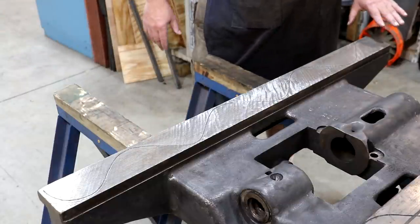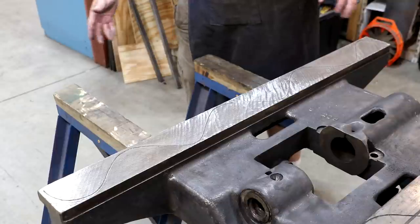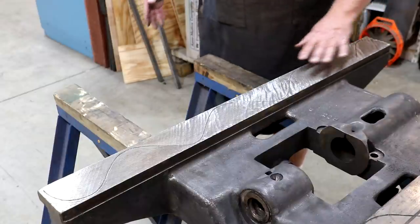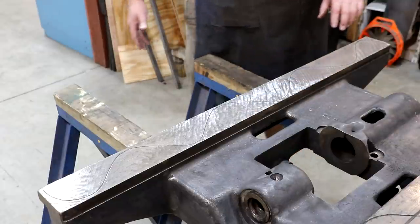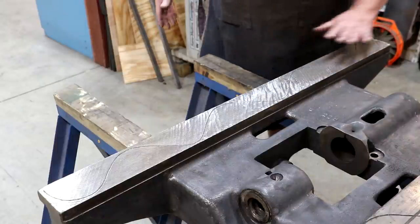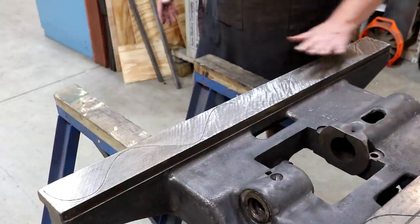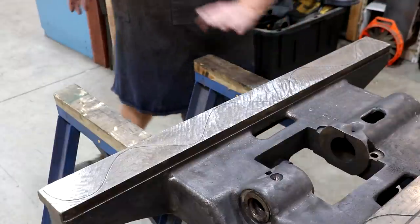Why do we scrape? Number one, I want to make sure that everything is flat. We're moving very small amounts of metal — each scrape mark is a couple of ten-thousandths of an inch deep. By repeating it and going over the high spots, we can get those high spots down. The other thing we're doing is creating little peaks and valleys on this flat surface. The highest highs give you individual points of contact between the two parts, and then there'll be lower valleys in between. That gives a place for oil to get in there and really improves the ability of these parts to slide on one another. If you have two perfectly flat surfaces like came off a surface grinder, they're going to want to stick together. When you put the scrape marks in, the peaks are all in a flat plane, the oil gets in the valleys, and it really makes for a nice bearing surface — such as in machine ways.